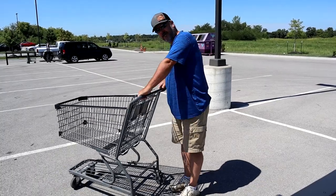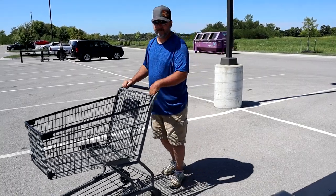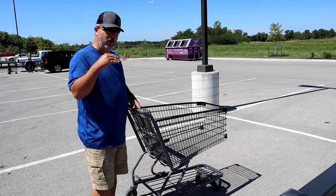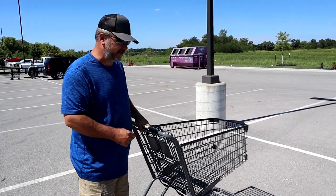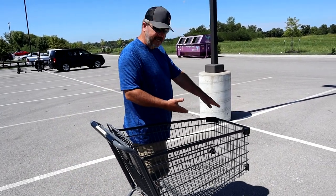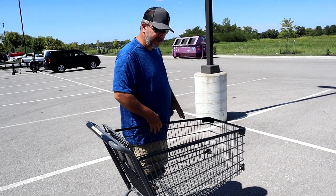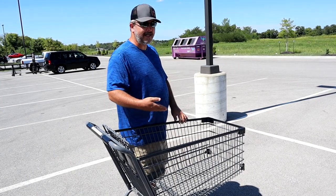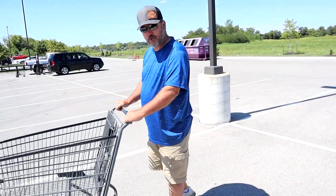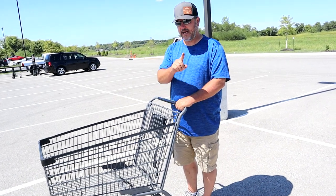It is just as unpredictable as a shopping cart. When you're on a side hill, the front end will want to fall down, and you'll need to push that front end back up as you're driving alongside the hill. When you're going down a hill, you lose a lot of traction on a zero-turn mower, because the casters are on the front end. You're sitting in front of the rear tires, so there's no traction, no driving effort, and no steering effort up front. Going downhill on a zero-turn is not the best option, and neither is going up a steep hill — but if you must do hills, it is better to go up than down as far as traction.